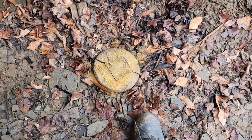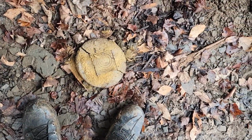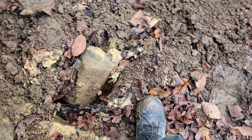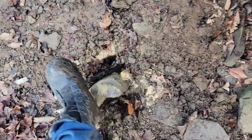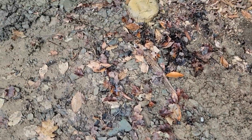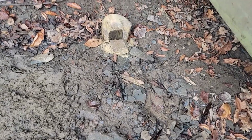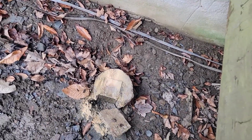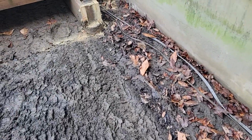Here's the same thing. You see the footing ain't worth a crap when you put a 4x post in it. This one just tipped right over, and you saw me, at idle on a wet lawn, pull that right out of there. This one here, see, it's crumbling. Just don't build like that. That's just foolish. You're gonna have a post in the ground, have a post. You have concrete, have concrete. Don't do both like that.